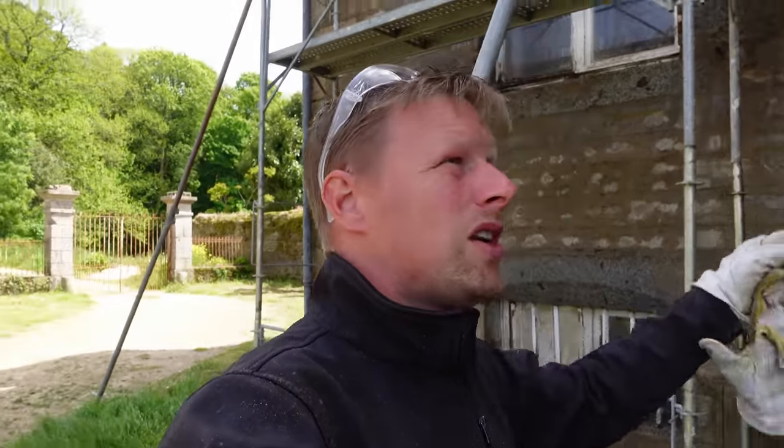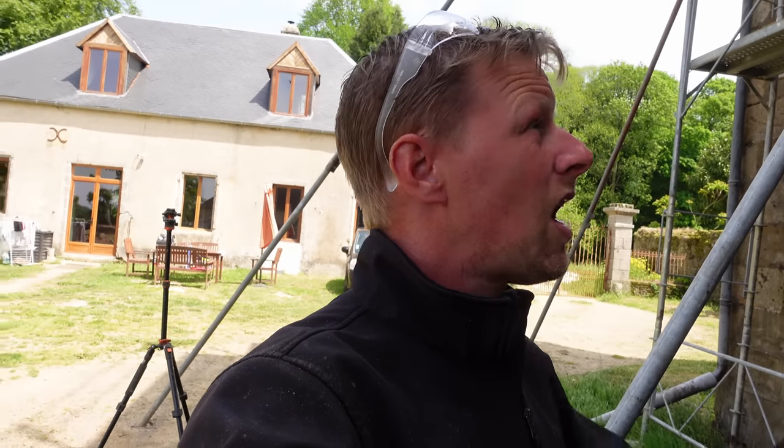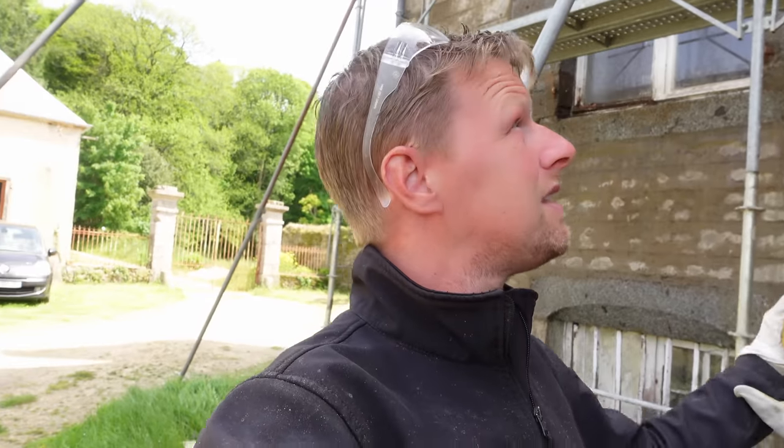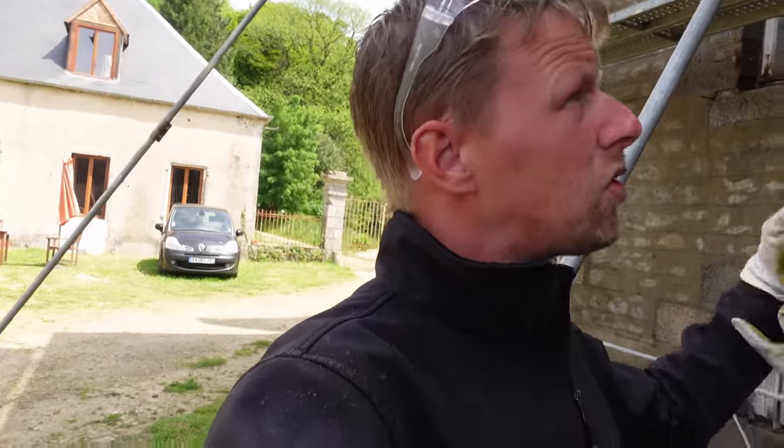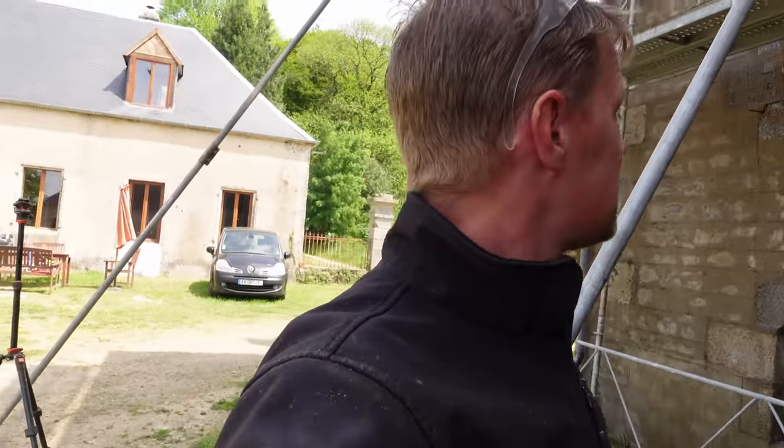It's working really well, obviously we're using the hydrochloric acid. We're putting it on, leaving it for about 20 minutes and then washing it off, and it's getting all of the black marks that are properly embedded into the stone or the cement. It's taking all of them off, which is really good. On the granite, we're going over a couple of times and it's slowly pulling the staining out. If it's from the metal brackets where they've rusted and stained the granite, we're just going over a couple of times with that, and it brought them back as well. They're looking absolutely fantastic.